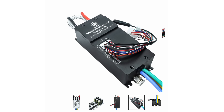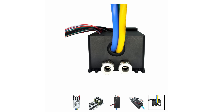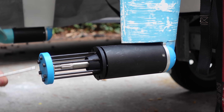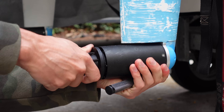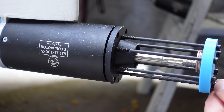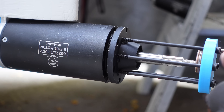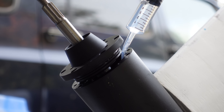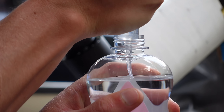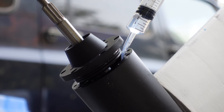After that I upgraded to the VESC 75-200s. These also have tubes through the inside for water cooling, but I don't have that set up yet. Another improvement was increasing the waterproofness of the motors — I'd read that these motors aren't really waterproof enough to be fully submerged for long periods, and some people had been filling them with mineral oil to prevent corrosion. I used a 3D-printed plate and some long screws to slowly pull off the motor end cap, and a few drops of water appeared inside. Then I filled the motors about halfway with baby oil, which is just mineral oil with fragrance — hopefully the fragrance doesn't dissolve the O-rings.